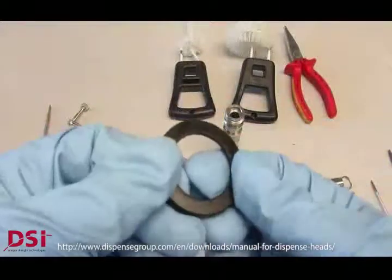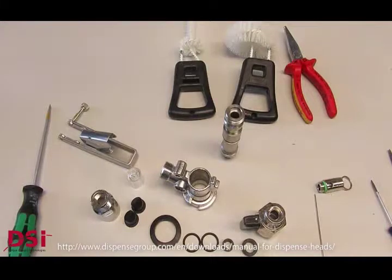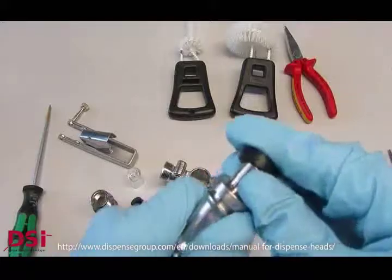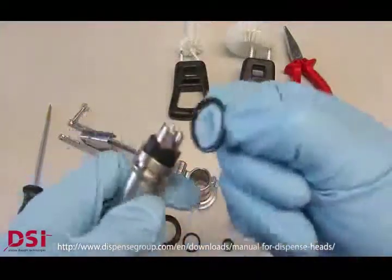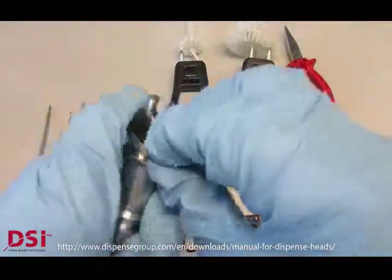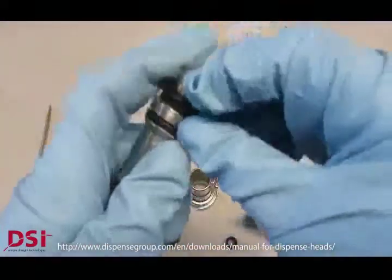That's not so easy. Please check afterwards if it is destroyed, and after reassembling, if everything is gas tight. If everything is cleaned, and in the last step cleaned by water only, we can reassemble the complete coupler. So we recommend to use new O-rings and all other gaskets as well if necessary.